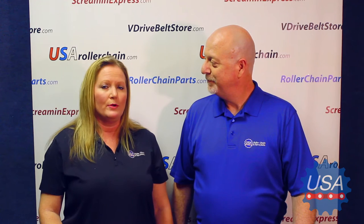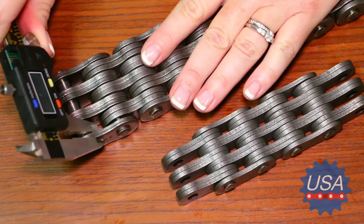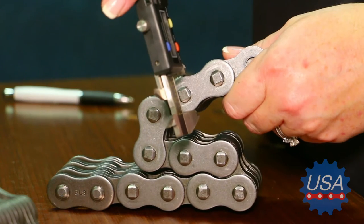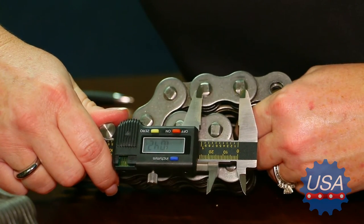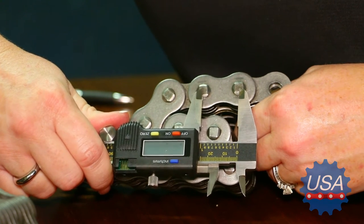What other information do we need to make sure we provide the correct chain? If there are no stampings on the side plate — letters or numbers — then you want to measure the side plate thickness to make sure you're ordering the correct series of leaf chain. If you take a look at the two chains side by side, these are both number 80 chains, but the BL series is noticeably larger due to the thicker side plates. Also, the plate height is good to check because the metric versions of this chain have shorter side plates. And the pitch of the chain, by measuring the distance from the center of pin to the center of pin on one of the outside links — the measurement is right on for the number 80 or 1-inch pitch chain.